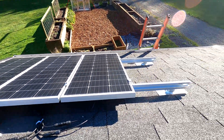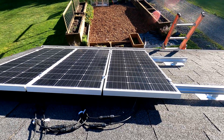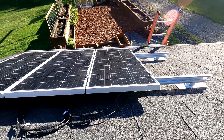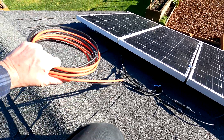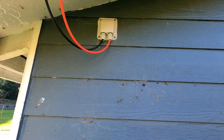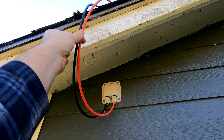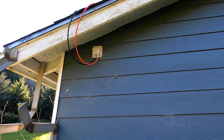I've got all three panels mounted and I've got room for a fourth — I'll probably order one. All I need is another panel, two more T-clamp pieces, and another Y connector to add another 100 watts. For now, everything is hooked up. I'm going to push the cables under the panels, zip-tie them to the upper rail, and run them down through the cable entry gland to the charge controller. I've also made a small standoff that screws to the underside of the fascia to hold the cables off the roof.